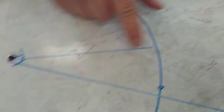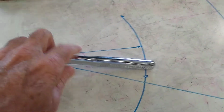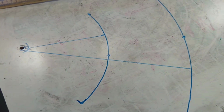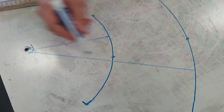So this is the radius that the bolt is moving right here, right? That right there, that little object. Now look at how much longer this little middle radius is for the medium-sized socket wrench, all right? And now look at how much longer this line is for the big torque wrench. However many times this radius line fits within these lines right here, that's your mechanical advantage, all right? And we can write it like this. The formula looks like this.